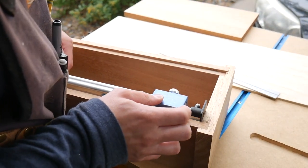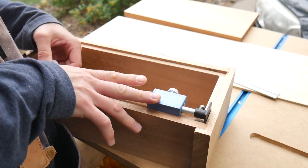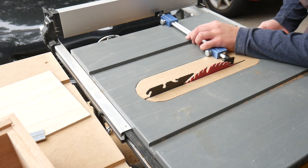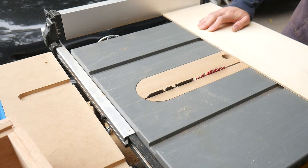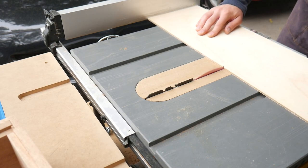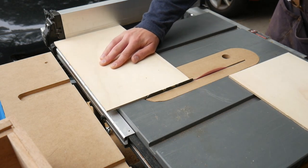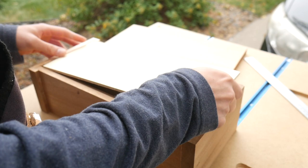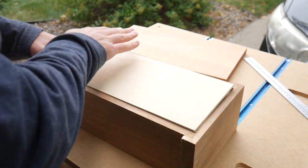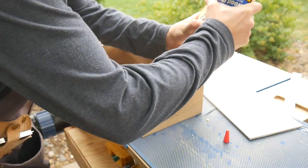After those inside corners are squared up, I start referencing that inside dimension to cut the bottom. You can use just two sticks or two pieces of scrap with a taper or clamp for this — I happen to have a little setup jig. I bring that dimension to the table saw and cut the bottom to the correct length and then to width. This is some sloppy plywood — I wish I'd used veneered plywood or Baltic birch — but it's all I had on hand. I'll be sure to upgrade the wood for the bottoms in the future.